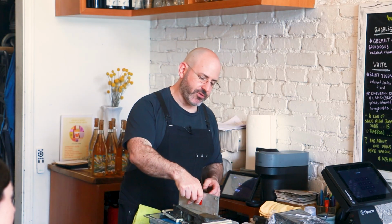Cool. We talked about stone fixtures a little bit before. It's really important that you're paying attention to stone flatness. So if your stone feels or looks not flat, that is generally the time that you want to flatten it. That doesn't mean you have to do it every single time that you sharpen, but it does mean that you want to be cognizant of that as you're sharpening. And you can look at that a lot of ways. You can take a reference plate and lay it across the stone and see what's going on. But often, if it's dished enough, you can just look at it and see that it's dished.